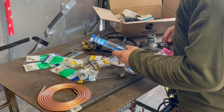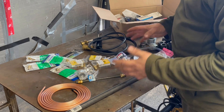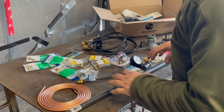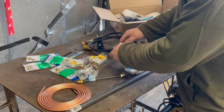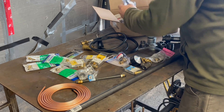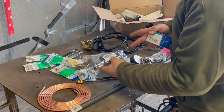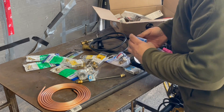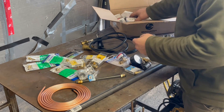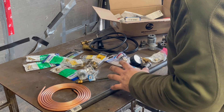The very first thing we started to do on this project is accumulate supplies, and this has turned out to be pretty expensive. I'm hoping a lot of this stuff is going to be used in multiple guns, especially a lot of the tooling. We've got things like tap and dies - this is the 14 by 1.25 that we needed for the spark plug. You need to buy drill bits, taps and dies, all that kind of tooling. Then there are brass fittings, copper line, gauges and regulators. These are the circuit boards I got off Amazon, and these are the 12 volt solenoids to control the gas flow. I'm hoping to be able to build at least two or three guns out of all these different supplies.